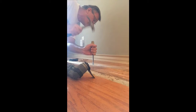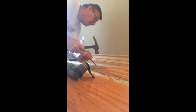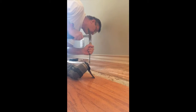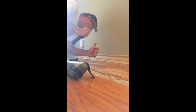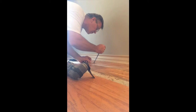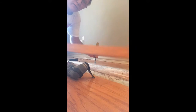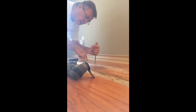If you're cutting through the tongue and groove — these are all connected with the tongue and groove system. Just get underneath it. You're going to be filling in the cracks with water-based polyurethane clear. That's what you're going to fill these cracks back in with after it's all over. Use water-based so that you can pour it down on the wood, because it's already pre-finished with a beautiful finish. We're just going to fill in the gaps with polyurethane. You take a damp sponge and wipe it off the surface, and it stays down in the crack.